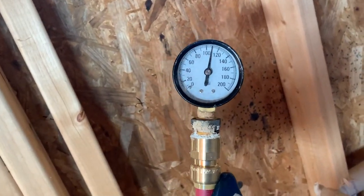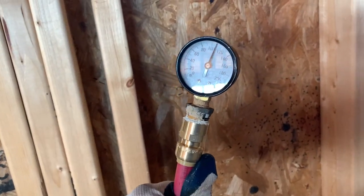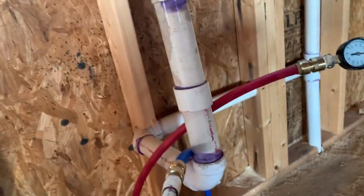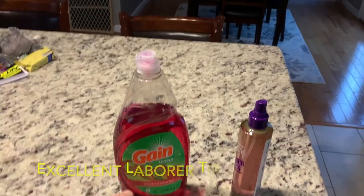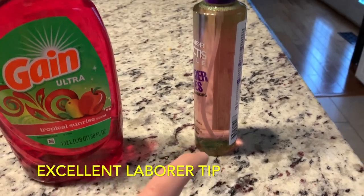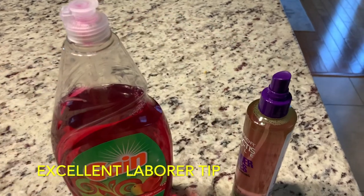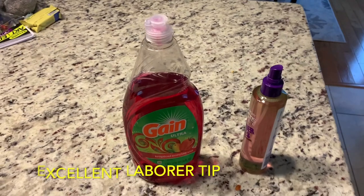We set at 110 and it's still at 110, so it looks like our pressure lines have passed. I was kind of hoping there was a leak I could show you how to find. Here's a soapy solution I brought in case we had a leak — just take some simple dish liquid and fill it in a spray bottle. You want about a quarter inch at the bottom and fill the rest up with water, making sure it's in a pump bottle.